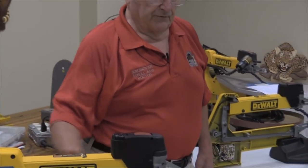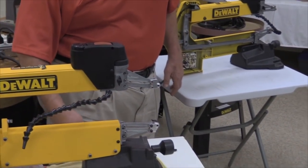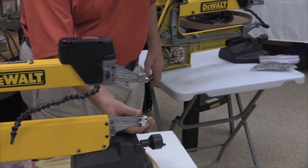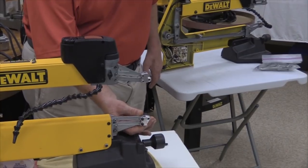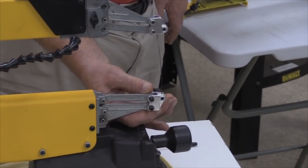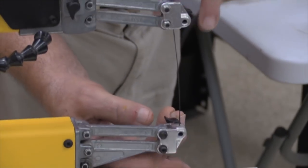One of the things that I have noticed in working with these things is that the quickest way I can find out if the problem's in the front or the rear, which makes a difference as to whether you break the case halves apart, is you take and wiggle this lower rocker assembly. And I don't know if Buzz has zoomed in tight enough on that thing yet. Make sure and get both of these, Buzz, off the bottom. Okay.